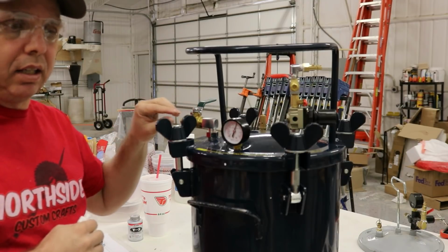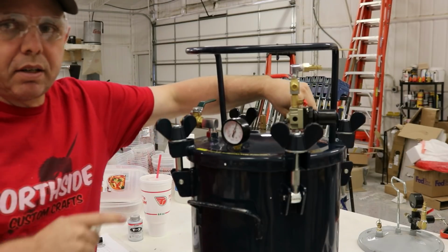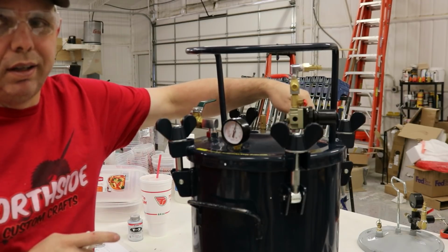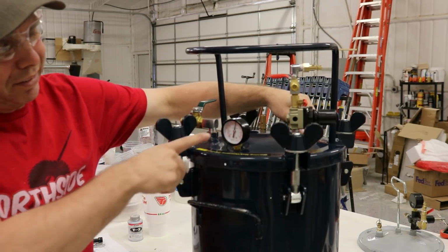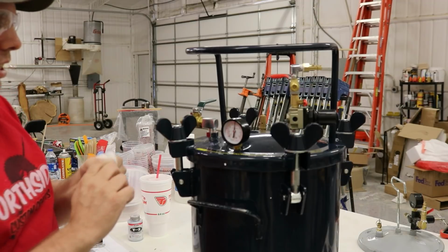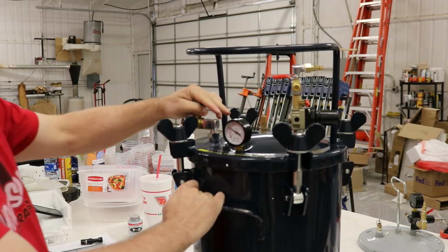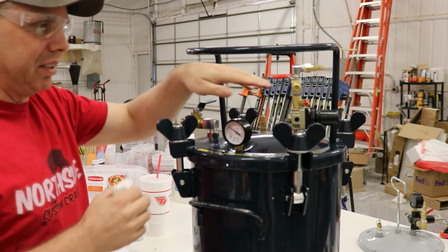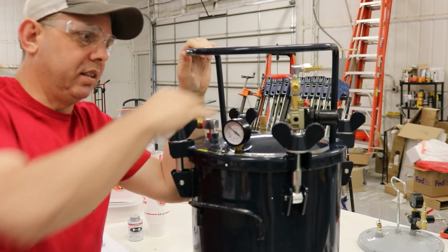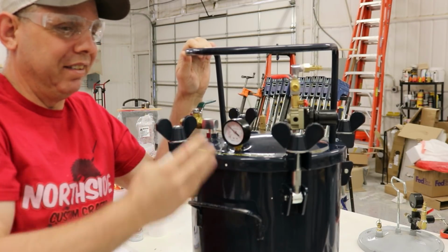air outlet. Like I love it on my other one because it just lets the air out faster. Otherwise, I'll do it right now. This one back here, the air outlet, you can see, right? So you'll have to wait for the air to get out. This one here we go. So the one that's set up just for pressure casting has this removed, which the argument to that is that this lid will be stronger.